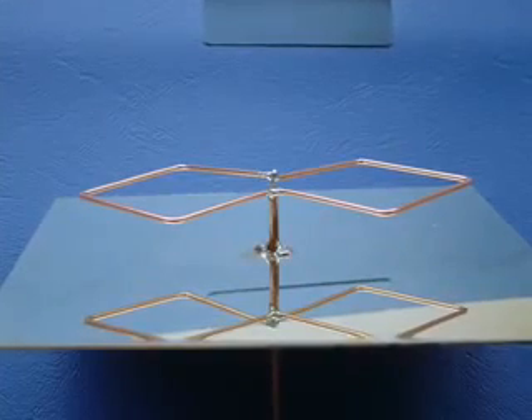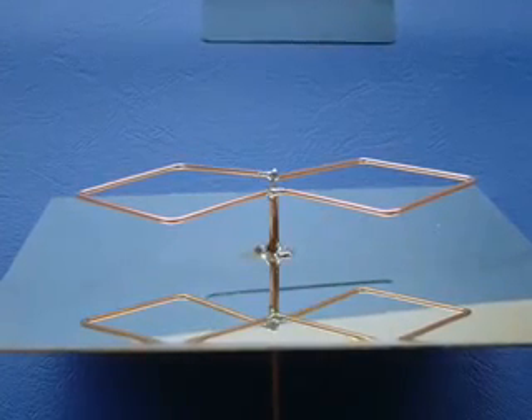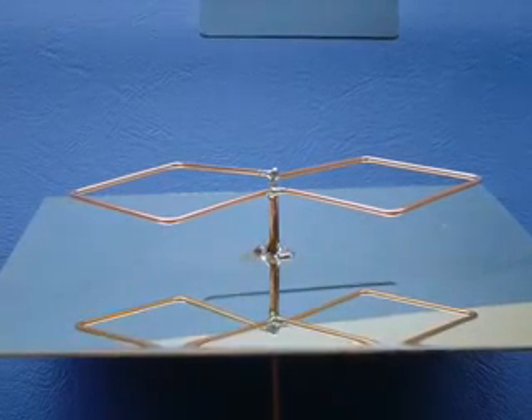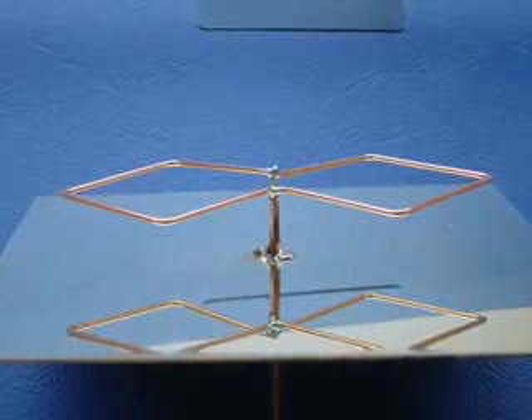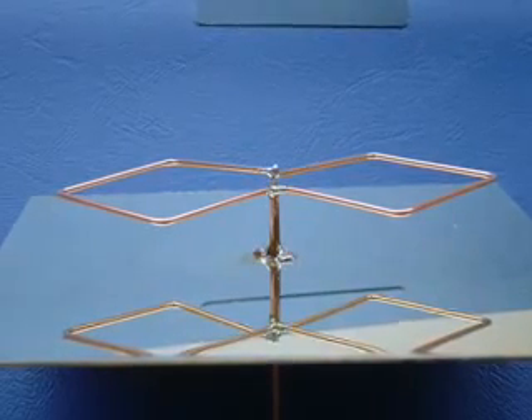The center of the double square has a continuing wire and two wires with open ends. The continuing part is soldered to the outer conductor of the semi-rigid, while the open parts are soldered to the center conductor. Make sure the wire is nicely parallel to the plate.